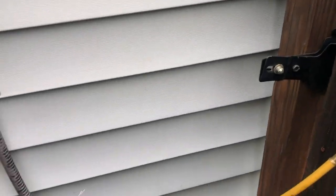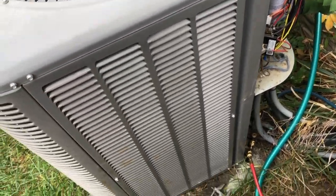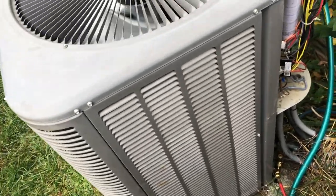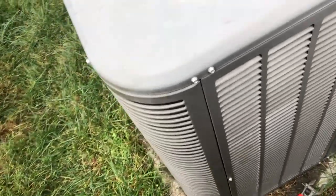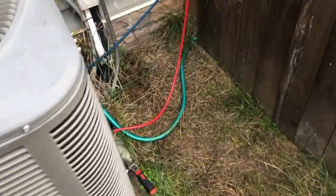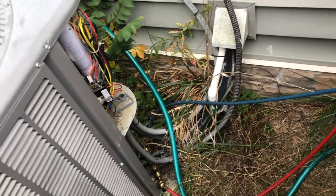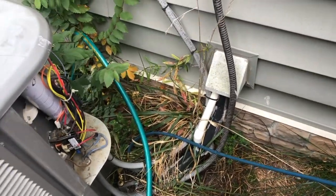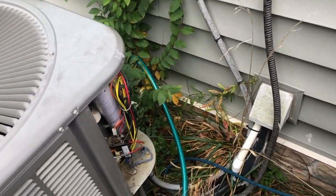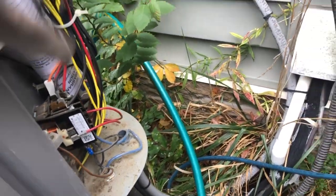So we can pull it all down here to the condensing coil so I can save that refrigerant and not have to replace it, because it's not contaminated. I don't want them to have to buy additional refrigerant if they don't have to. So I'm going to finish pumping this down, close those valves, allow that refrigerant to flow down, closing the high side. Then when it drops to zero, close the low side, do the same thing, and then shut the unit off. I'll pull that disconnect. I could have jumped it off, but this is much simpler to me.